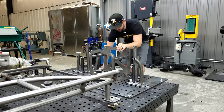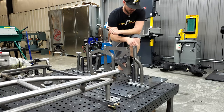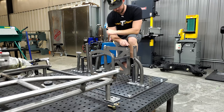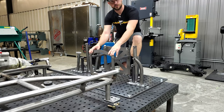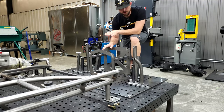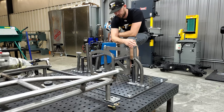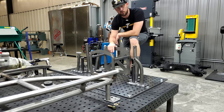We'll make sure that this tube, when it comes back here, comes back flat and then bends around here at some point to pick up those rear body mount locations. At that point there's going to end up being another cross tube of some type — either a tube or maybe some plate — to be able to pick up the mounting locations for the differential. Basically the whole point of getting the body back on here is just to double check clearances to the back and then figure out how and what we want to do as far as crossing over this way.